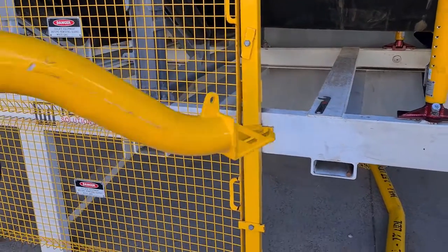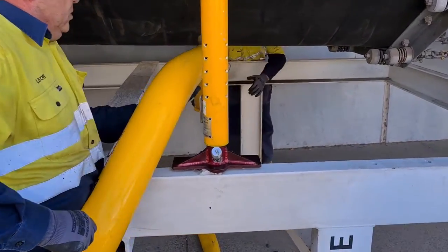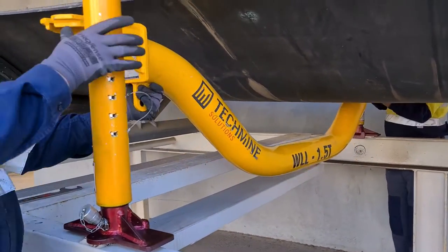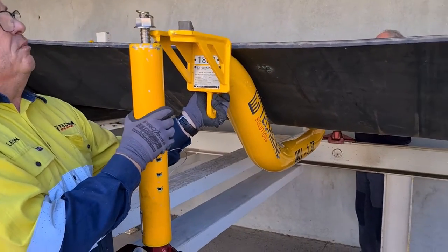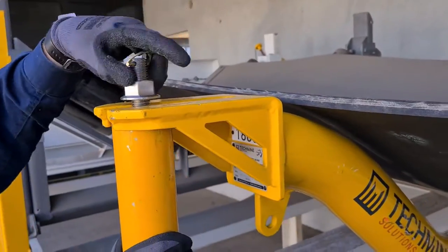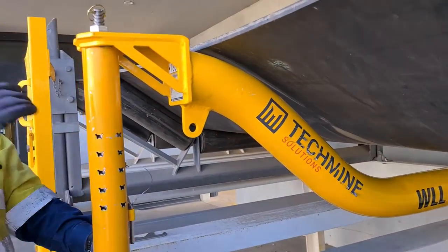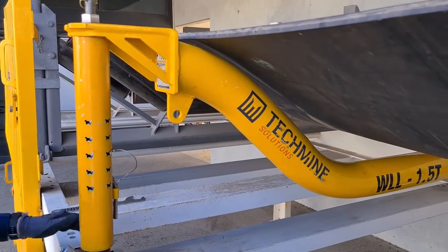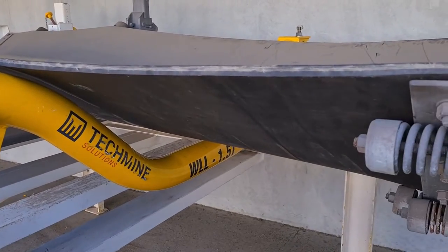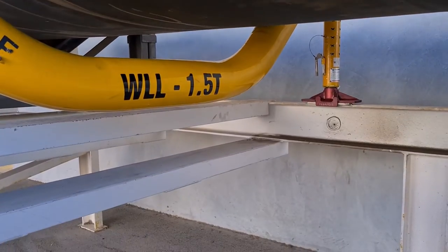I'm going to pass the trough beam across. You can see why we don't need to take off the nut — we have a slot that the telescope mounts through onto the beam, and that is sitting central on the beam on both sides of the slot and centralised onto the conveyor system. We now have the beam and the telescopes on.